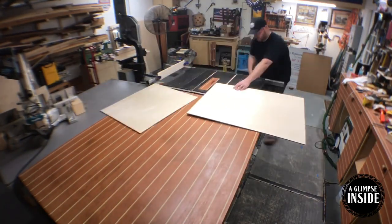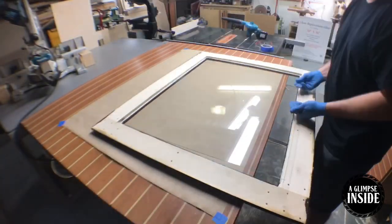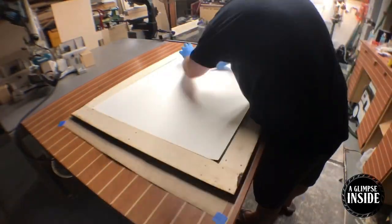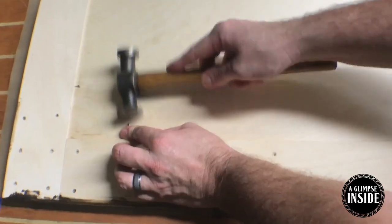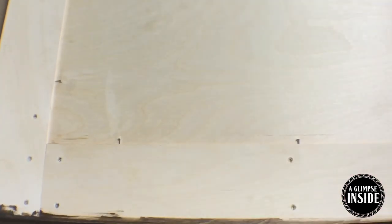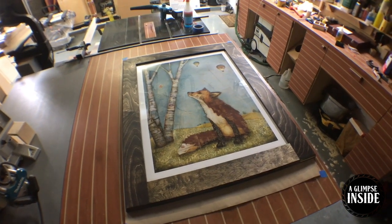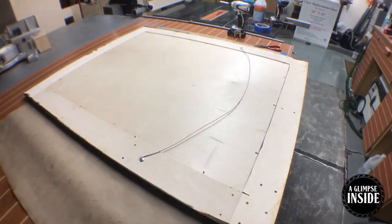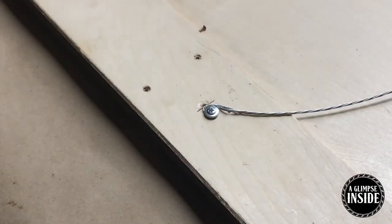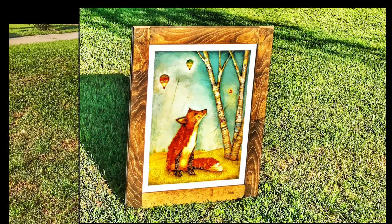My next step is to take a piece of quarter-inch plywood and cut a back for the frame that's going to hold the glass and the picture all together. I go ahead and get the glass cleaned up with some acetone, getting the handprints and stickiness off of it. Lay the picture in there, put the backer on, and attach it with some simple pan head nails. As I install the last nail in the back, I flip it over and realize we have a little happy accident — the birch trees in the picture match the Baltic birch plywood the frame was made from. I attach the picture framing wire on the back with some pan head screws, plus one more screw right through the wire for added security. I took it outside in the sunlight to give you a better look.